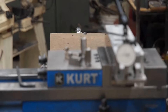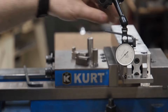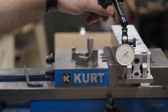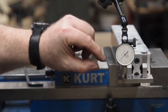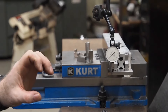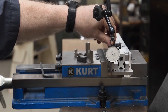Now we've got to line up this axis. You can see we're low over here and high over here, so I'll come to the low side. Over here we have two screws. There's a puck inside here and it's got two pins — it's hard to explain exactly what's going on, but there are two pins inside this puck with 10-32 screws. If I tighten one and loosen the other, I can actually make that puck move on the inside and it will adjust this axis.